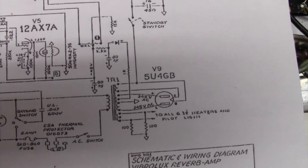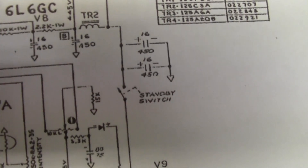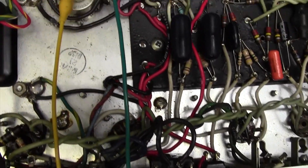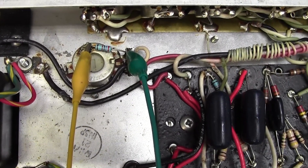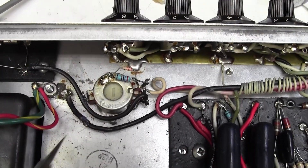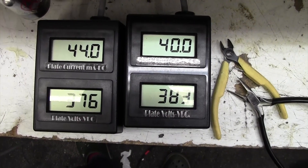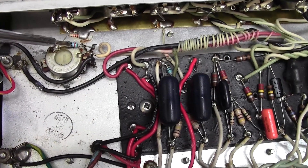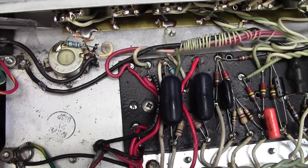Let's have a quick look at the circuit schematic. Lo and behold, that resistor is 15k — that's what it should be. So the correct resistor is 15k. I'm just going to solder a 22k across that existing one — that's the easiest way out of this — and then double check the bias and we're good to go. There you go — I've soldered a 22k resistor across it. Back to the bias meters: we've got 44 milliamps and 40 milliamps, which is perfectly okay. I'm happy to call it a day on that.